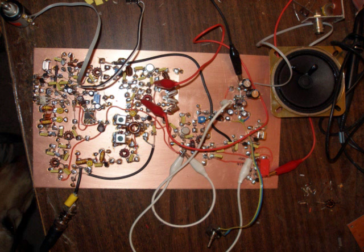Looking left to right, first of all you'll see the VFO, and that is comprised of two oscillators mixed together to create a 19.1 megahertz VFO signal roughly. On the top is a ceramic resonator oscillator at 4.19 megahertz, and to the left of it is a 15 megahertz crystal oscillator. Those are mixed together and filtered, and then there's a couple of broadband amps to get that up to a good 6 volts peak to peak or so.